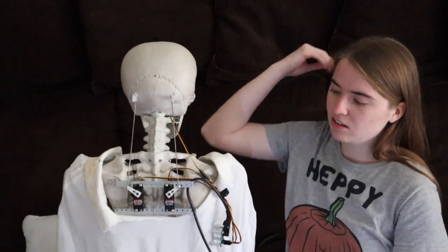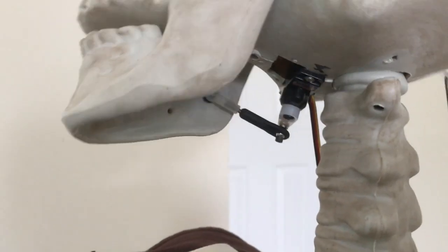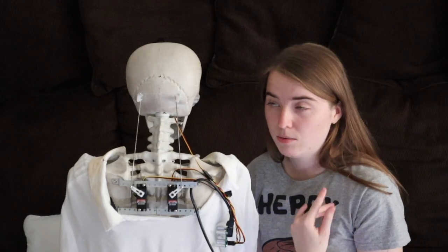Last but not least, let's take a look at that jaw mechanism. All four pirate characters have a micro servo in the bottom of their skull that controls their jaw. Cut a hole in the skull, pop the servo in, screw it in place. Then we just use this fancy little swivel rod here to connect the horn to the jaw — it's another RC airplane part, but you could probably get away with using a paperclip here if you really wanted to.